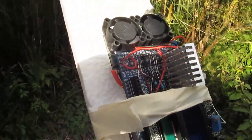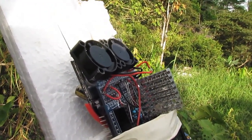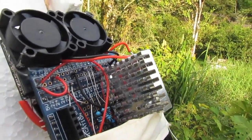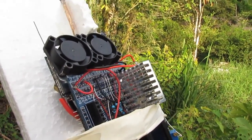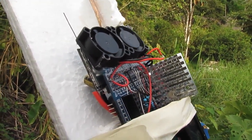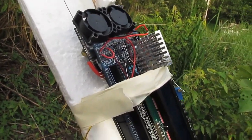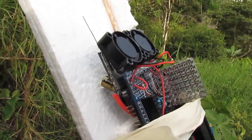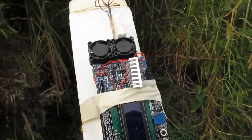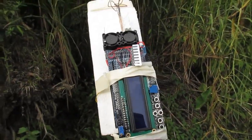Now I've modified these receivers so instead of doing the normal, I think it's the normal 8 channels, they'll do 24 channels now. So I get the full range of spectrums. Previously there was a big gap in the middle, it would do the 5.7 gig and then around 5.9 gig with the four channels on either side and a big gap in the middle. But because I've modified the receiver modules, I get the full 24 channels, which the chipset allows. And that's allowed me to tune the frequency I'm using to the antenna rather than the other way around. Anyway, moving on,